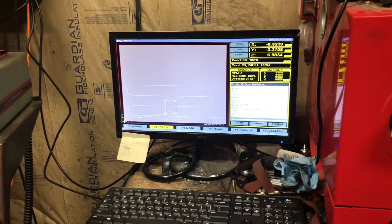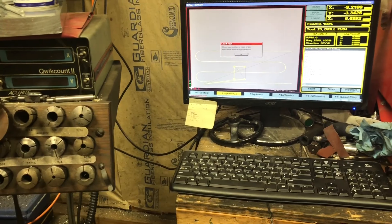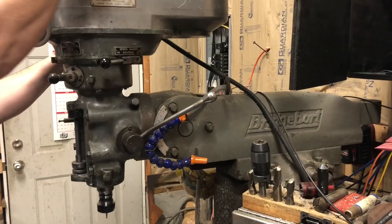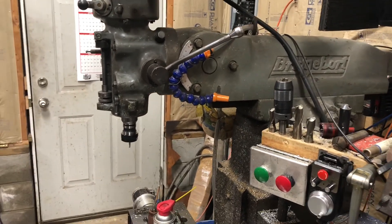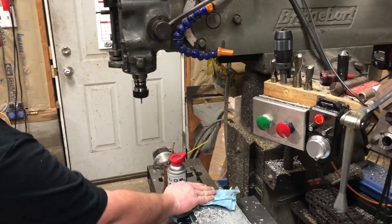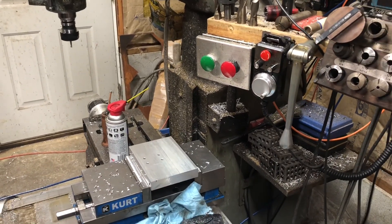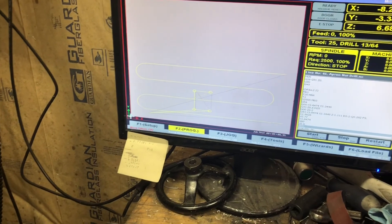Now we're going to do a 3/16ths end mill. The Masso is sitting here; it's been running pretty good this evening, other than some operator error on my part. It definitely doesn't like dull drill bits. The Z height had enough power that we had to re-square the mill head — it shoved the mill head up out of position. It didn't break anything, but we did dislocate the drill chuck out of the Jacob's taper. It was pretty rough. The drill bit stopped spinning, the Z height didn't slow down — it just came right on up. We didn't break anything. So here we go, we're going to take off and do this small end mill.